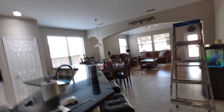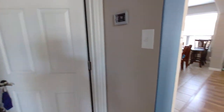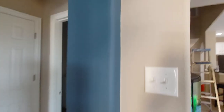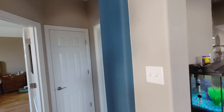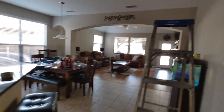There's another rounded corner here that I did — you can see how straight a line that is using my technique. Whenever I do two colors in an inside corner, I always do a pretty good-sized bead of caulk. That way when you go in freehand to cut it in, it makes a straight line, because the texture is kind of jagged.